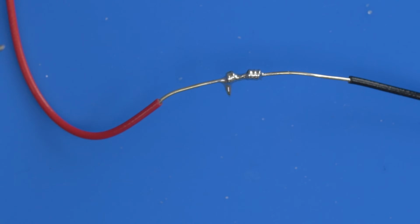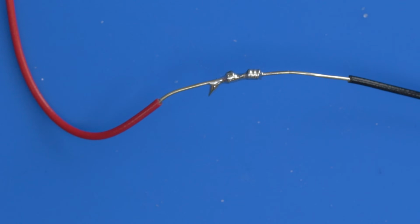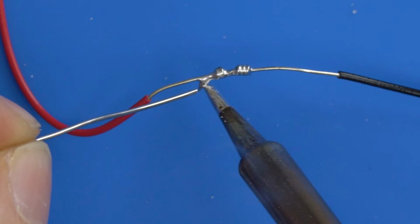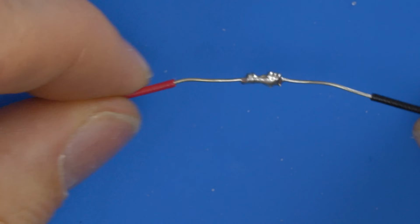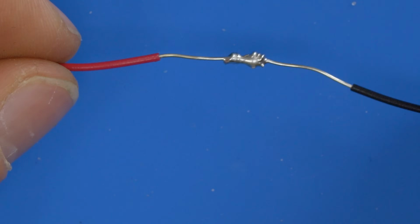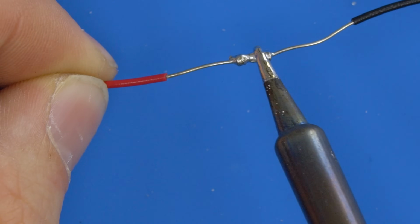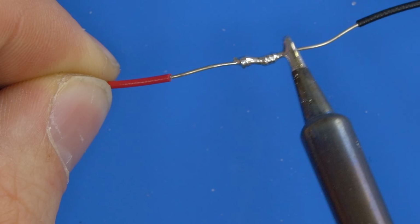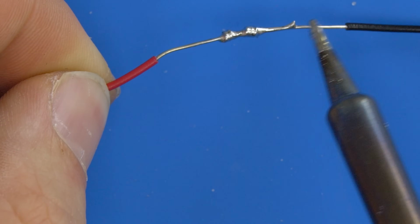And you can see how we've got the dry bit there from being on too long. Oop, holding the iron way too far apart. There we go, and we just rub along, and I may have excess solder there doing that, but as we spin around you can see it's filled in all the grooves. It's not a very clean joint. You know, when you rub across you've got a bit of dry solder.